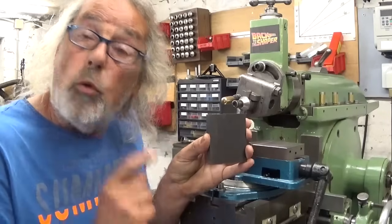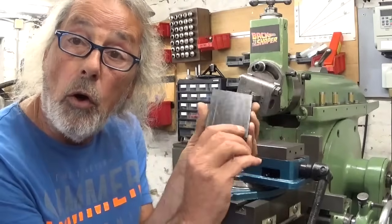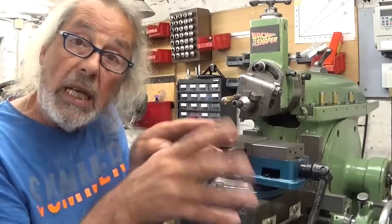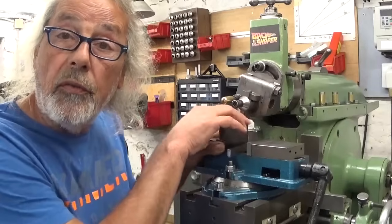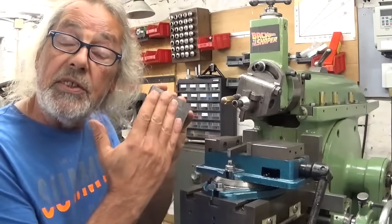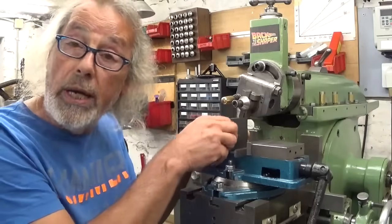Normally, when you start squaring up a part, the best way to do it is of course to start with the biggest surfaces. This one or of course on the other side. So install your part this way in the vise on parallels, of course. Make this surface nice and clean. And then we rotate 90 degrees and do one of the four other sides, and then it is of course the second biggest surface. And why is this? Because of course this surface will touch as much as possible on the fixed jaw of the vise. Make sure it will be square.